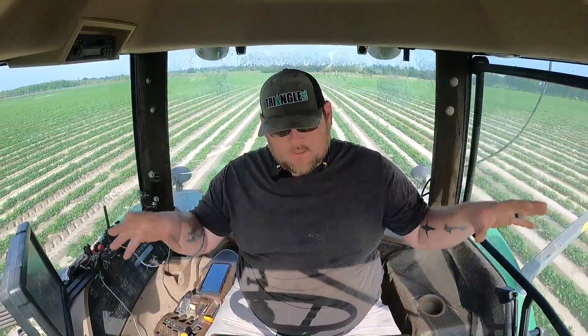So that's why we do it. That's why we use our little homemade rig. It's on 36-inch spacings, which is directly over the peanut instead of 18 inches like the bigger sprayers that just broadcast across the whole field. Everything's been going real smooth, and I say that - in 30 minutes I hope I don't have a breakdown. Y'all come take a ride with me.